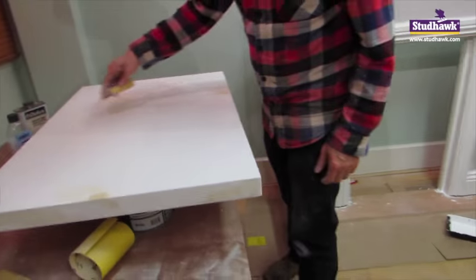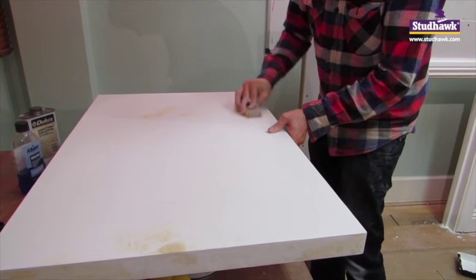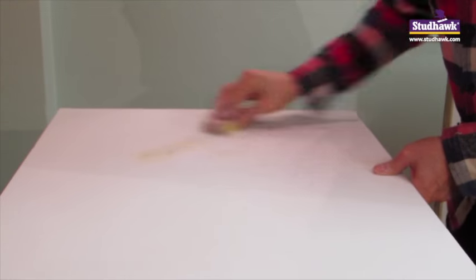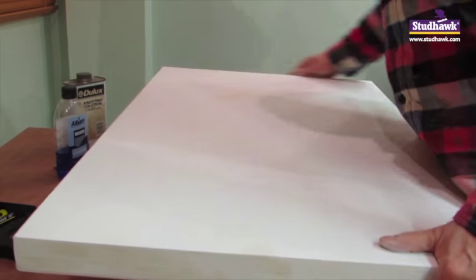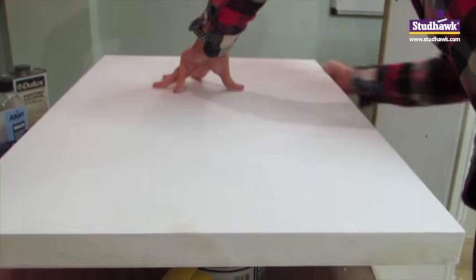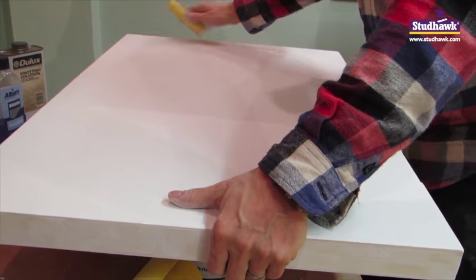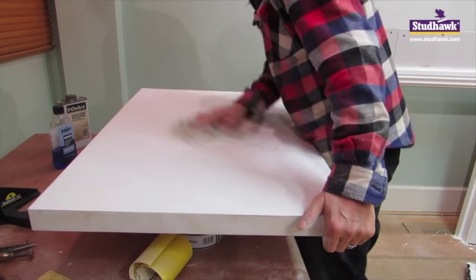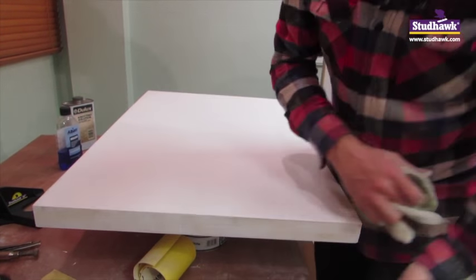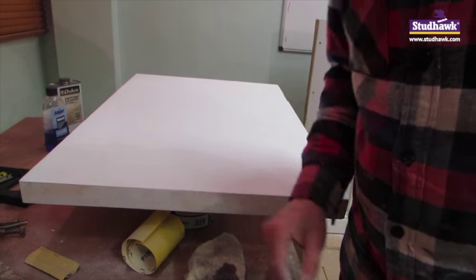The door's on its back — we had a couple more tiny imperfections, so we've done them with a two-pack filler. We'll go over with the block — it needs a round milling action to get these filler areas down, going straight across. We've even put filler in this edge, all around. Once touch-dry there's another wipe. Quick dust off so we don't pick up all that paint dust on our rollers, and we're ready for the last undercoat. It might need a third, but generally if you do it with a primer and two coats of undercoat you should be ready for your top coat.